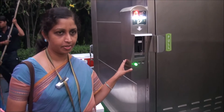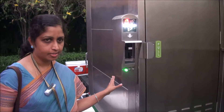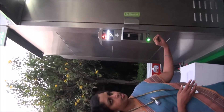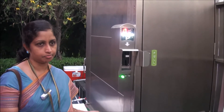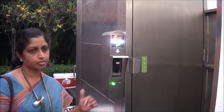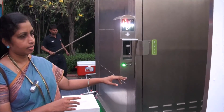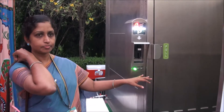This is the general public e-toilet, installed in 300-plus locations in India. It is an urban, unmanned model. You can insert a coin to enter. Though we call it electronic, there is no complexity for a normal user — you can use it just like a normal toilet. The electronics include sensor-based lighting and fan that activate only when someone enters, automated flushing, and a self-washing mechanism. There is also a web interface ensuring the toilet is up and running — if it goes down, an alert is sent to the control room and a service engineer is dispatched. If there is low water, the toilet closes by itself so it won't allow a person to enter and dirty it.